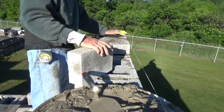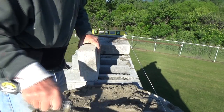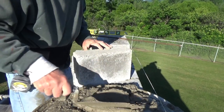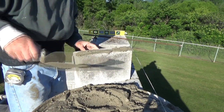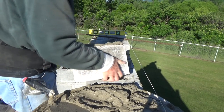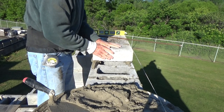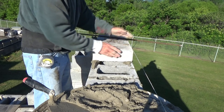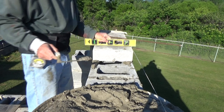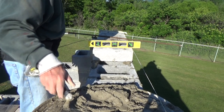Now here's what's going on: we've got to lay a four-inch cap on top of the wall. One of the biggest reasons is because we need 20 inches of ceiling height to get the garage door in, so we've got to come up an extra four inches. We're using a four-inch cap, going against it like this, down to the line. Got my dollar store level I bought for a dollar — works dandy.